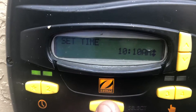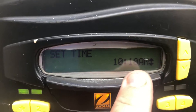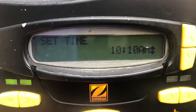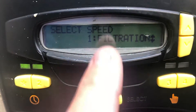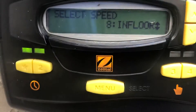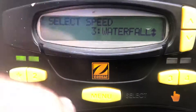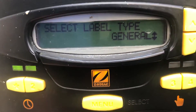Set time — this is where you're going to go ahead and set your time of day. Select it so that everything is on schedule. Scroll up or down to select the current time of day. Label speeds: here if you wanted to change label speeds, you can do that — flow, the eight speed, the seven speed. If you wanted speed three to say cleaner instead of waterfall, you can select into that. You can select from generals or make a custom one.